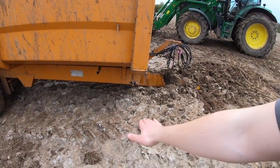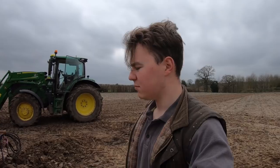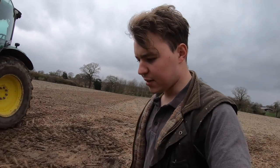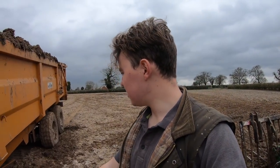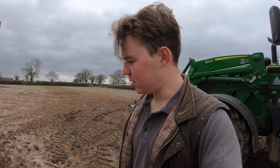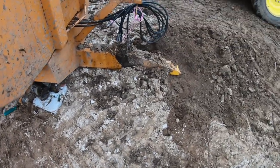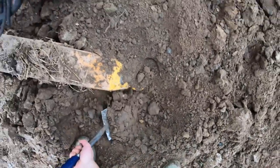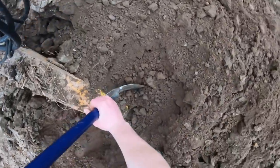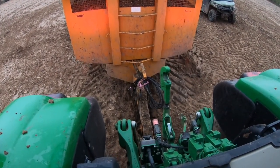I'll need a block of wood as well underneath the jack so that it doesn't sink in too much. But this is one of the drawbacks of having a front loader or loader tractor — you do get these problems. They can't lift the same amount as a telehandler. If I had a JCB or a manitou, you would easily be able to pull this out of the ground. I've managed to jack up underneath here — I put a tractor weight on there and then my Dunlop jack — and I'm just going to start digging out the eye of the trailer.